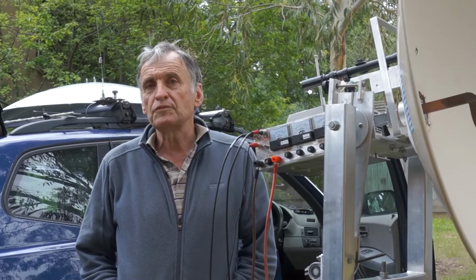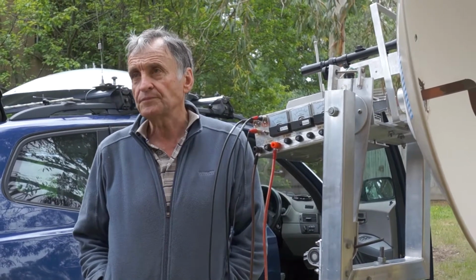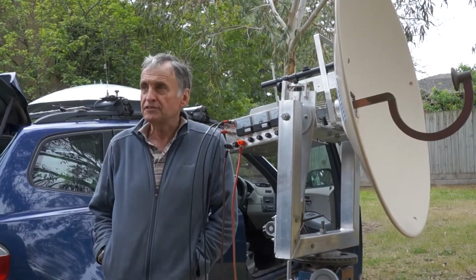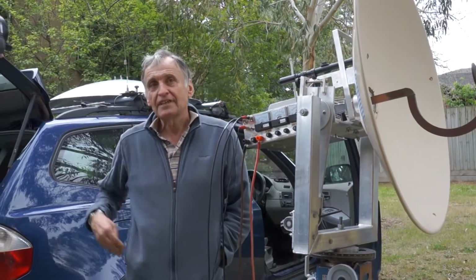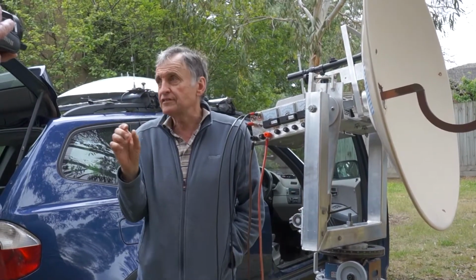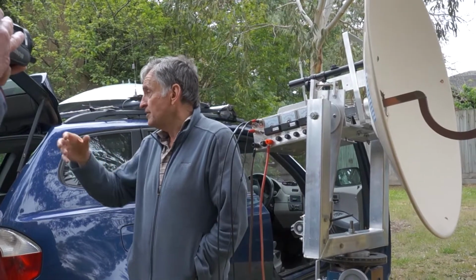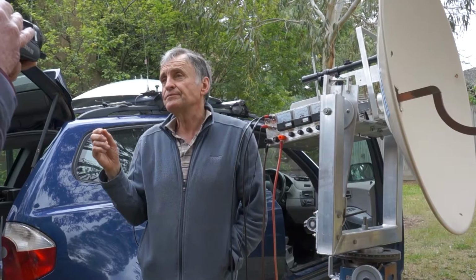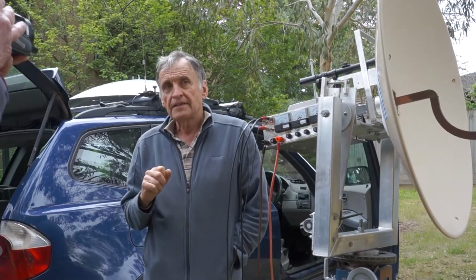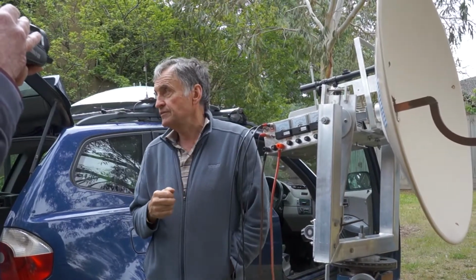So Joe Taylor, who wrote the WSJT suite, developed this mode called JT4, which we have been able to develop further in conjunction with Joe. We just keep giving him hints and challenges and he improves it. The way the mode now works is it starts with a narrower bin width and tries to decode your signal and thinks, no, didn't do that. Then it doubles it, and then doubles it, and then doubles it again, until it ultimately matches the bin width to the spreading off the moon, and you get a decode. And with that technique, we're able to use digital modes up into the microwave frequencies.